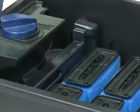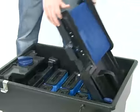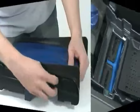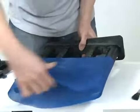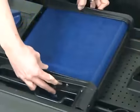Remove the zeolite cartridges and clean under running water, then replace into the filter. Clean the water distributor, then replace the ScreenMatic unit into the down position. To clean the ScreenMatic unit, depress the blue clips on either side of the screen and remove the screen. Unscrew one side of the screen using the blue locking nuts and remove the side of the screen. The mesh screen can now be removed and cleaned under running water. Clean the brushes of the screen, then replace the mesh. Replace the side of the screen unit and secure with the blue locking nuts. Replace the screen onto the holder and ensure the locking clips locate onto the base.